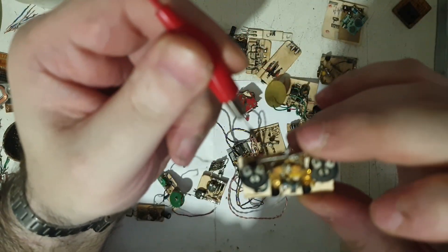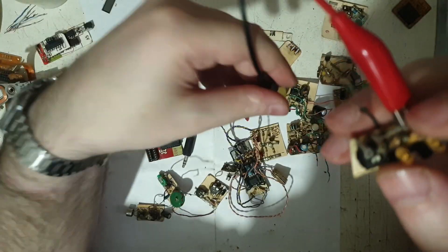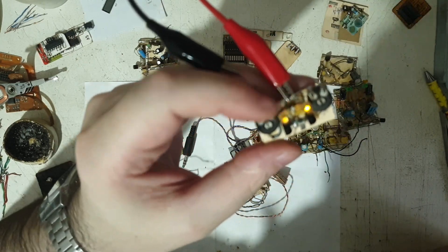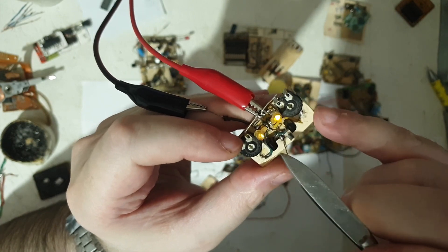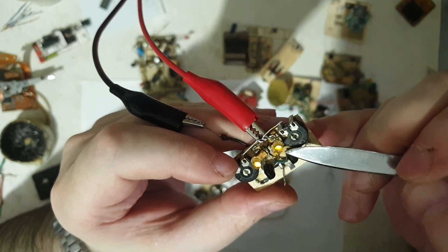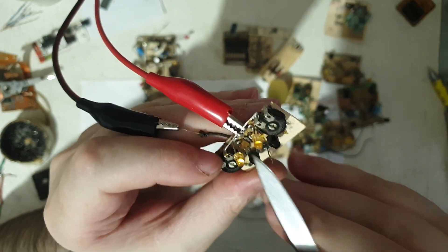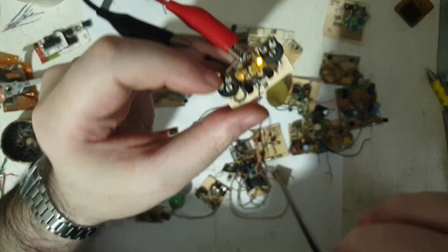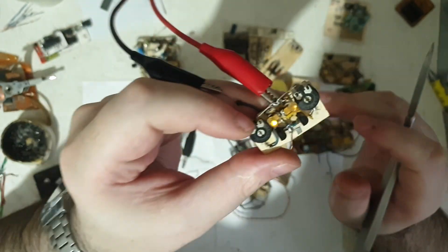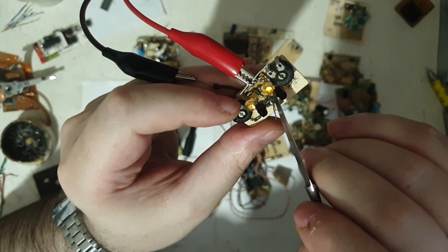Let me demonstrate it. This is also one of my first experiments with SMD components. The two yellow capacitors are through-hole, and the transistors are through-hole, but the resistors are on a small square board underneath — soldered SMD on the other side onto tiny pads on the LED legs. When you look from the front you can't see them. It's a very devious circuit, with an SMD resistor hidden on the lateral side.